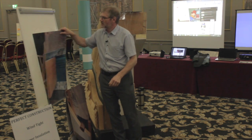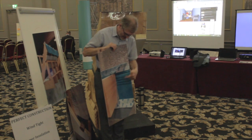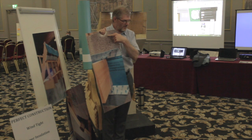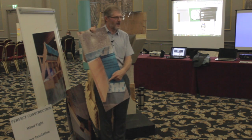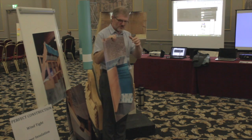The middle floor issue: traditionally we were leaving a gap there. The middle floor and the attic are the two coldest parts of the house — if there's block work, air is flowing through it and we need to block that off. There's a lovely detail where at the planning stage somebody said, before we put those joists in, let's put a little membrane there first so that when the joists go in we can continue the air tightness layer. In this example it's wet render downstairs and wet render upstairs, so the joist hangers are there but the air tightness layer is behind them.